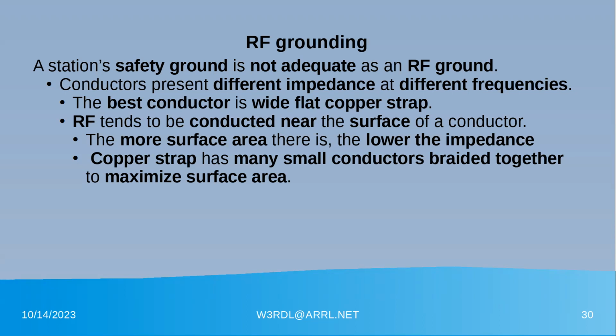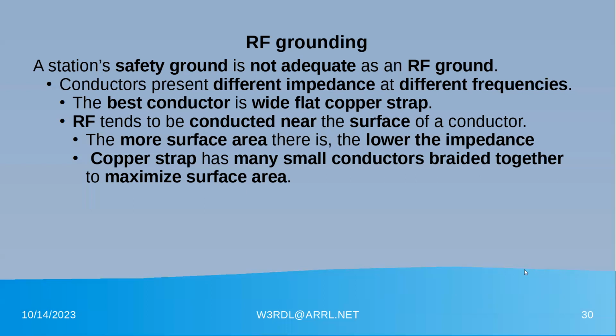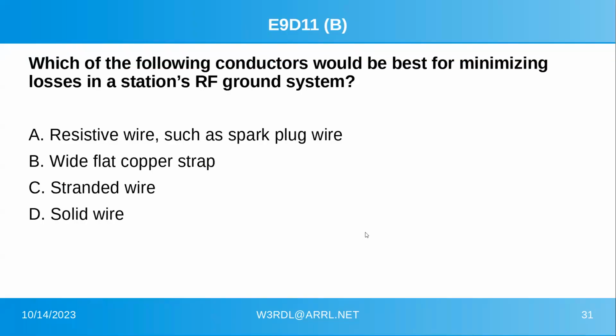Disconnect everything when you're not operating. Well, but when you're operating, it makes a difference on your ground. Because if you have a very high impedance to your ground, you don't really have a ground for RF. I never run a ground when I'm QRP. Well, I do sometimes. But yeah, you're a different case. Not only when you're QRP. Okay, mobile operation, you got a ground rod on your car? True. I could drag a ground strap, I guess, on the road. I've seen that.